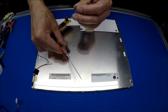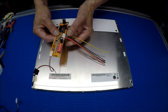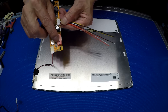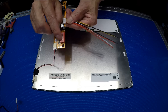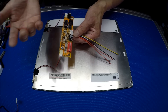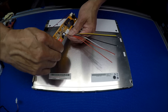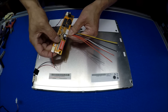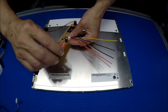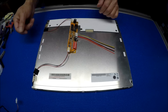Most industrial applications do not have ADJ, which is brightness adjustment. Yellow is really important — this is what we call enable, to turn this driver on and off. As you can see, the device has DIP switches. For this UB36 series, switch one is on as default. If you want higher brightness, turn on switch seven — that means brighter. Or if you want lower, turn on two and five. You can find all this information on our website.